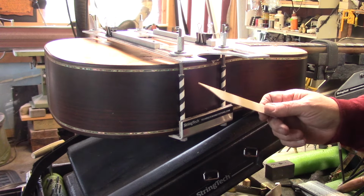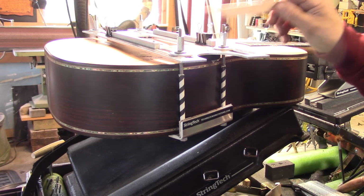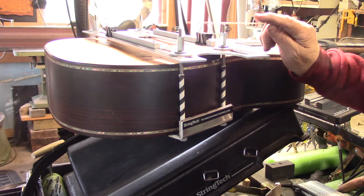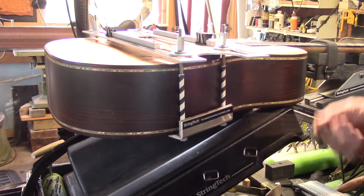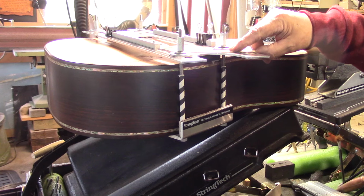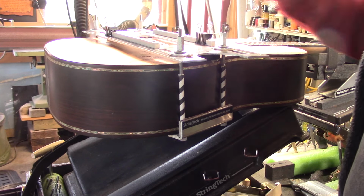So before I pull this apart, I wanted to explain there is a bunch of geometric considerations you need to take into account when you're doing this job. It's not just a matter of lining up the cut, but the plate itself needs to be absolutely perpendicular to the slot. And that's where these thicknessed hockey pucks go underneath that aluminum plate and hold that whole platform, the whole plate, completely perpendicular to the slot that we're cutting.